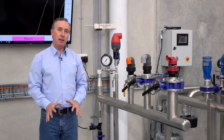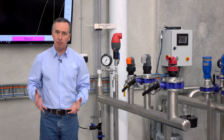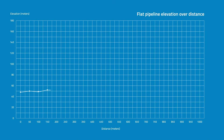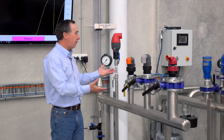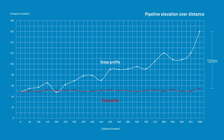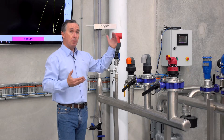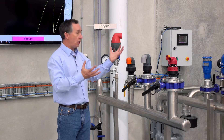So let's talk about what this means — what does sealing pressure mean when you're designing a pipeline? If you had a fairly flat topography pipeline, say one kilometer long with only two meters of static pressure between the start and end, when you turn the pumps off you're going to have very low pressure, and if you don't have enough pressure for valves to seal, they're going to leak. Conversely, if you have a very steep pipeline with air valves at the high point, because some valves need three, four, five, six, even ten meters of water pressure to seal, your pumping pressure has to be enough to get over the pipeline and also enough to make these valves seal.